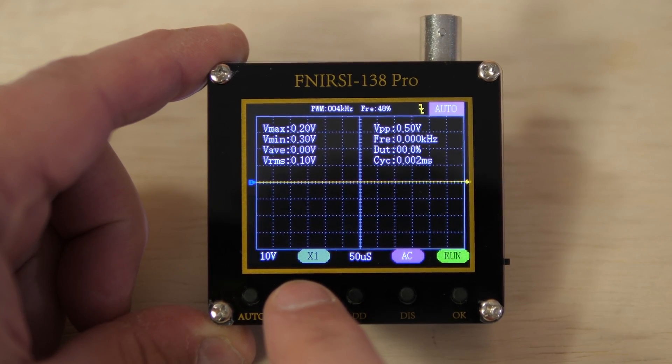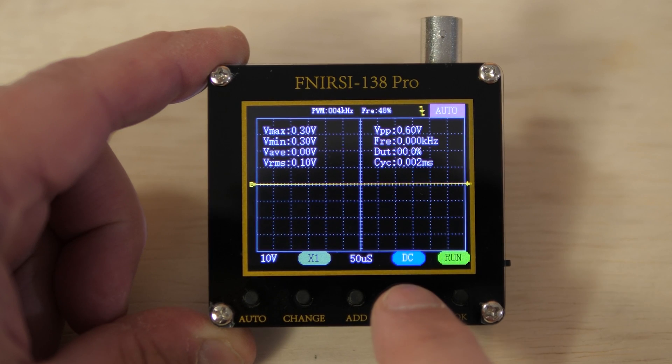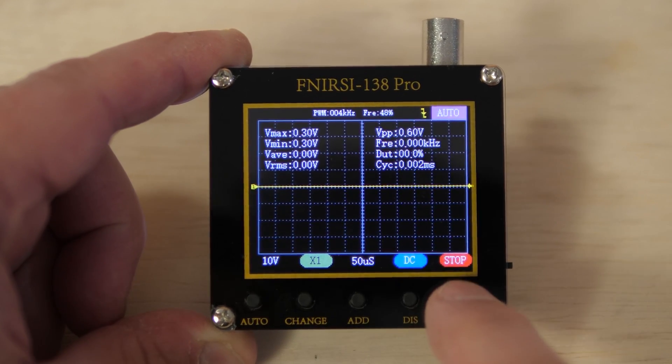Also, a lot of the examples I showed here — after I hit auto, the voltage was set to AC, but I double and triple checked the measurements afterwards and they all ended up being fine. Here's the very easy way to manually switch it to DC after hitting the auto button. I'm not sure if it's a huge deal in the context of what we're testing here, but it's good practice. When you're testing the RGB video signals from RGB or VGA connections, you're going to need a very specific test pattern in order to get accurate measurements. However, when you're measuring sync, all you need is whatever device you're using powered on and running software or playing a game, and the sync signal will always be at its maximum voltage peak to peak.